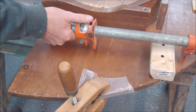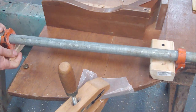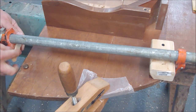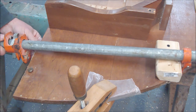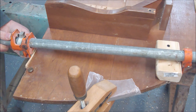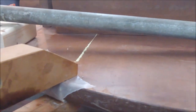I'll repeat the same process on the other side. You'll see what I'm doing with the wood clamp and wax paper — that's just keeping my two surfaces even and flat. I'm using the bar clamp to pull my glue joint together. As I clamp this up tight, you're going to see glue squeeze out — that's perfect, that's exactly what I want.